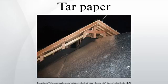These membranes, usually made of advanced fabrics, have advantages over traditional roofing felt and tar paper. They are more durable and less prone to puncture and tear, lighter, stronger, and come in wider rolls, though quite recent in the market. There are also breathable variations, which allow water vapor to pass through the felt. When used in conjunction with proper ventilation, they help minimize condensation in loft spaces.